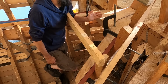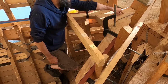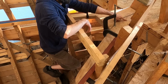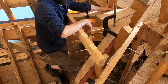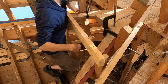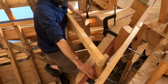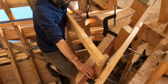Now these are all going to get through bolted. So there'll be a bolt that goes through the breast hook, or all the way right through the centerpiece here, right through the stem. So that'll pull that in. There will be a bolt that'll go through this frame, through the nose of the wing, through the center blocking, through the nose of the wing, and out the other frame. That'll get through bolted. This up here will get through bolted, and then through bolts will go through the frame, through the clamp, through the wing. Same thing over here, and then back here as well. So by the time all of this is bolted together, it should be pretty strong.